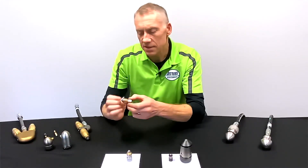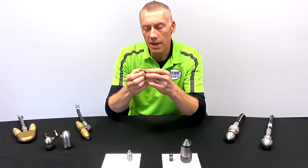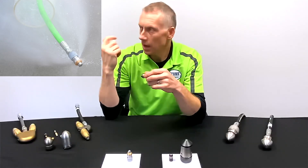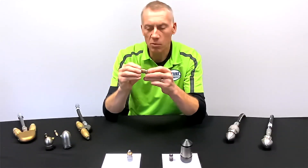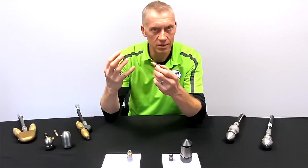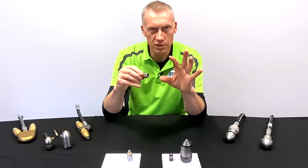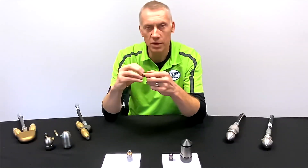The knock on these is they leak a lot. A rotating barrel spinner is not internally oiled — actual water comes through and leaks out at that point to create lubrication. You can see in the video how much leakage is coming out from the front of that nozzle. This cheap one probably loses close to a third of its water to leakage. To underscore that: if you had a 10-gallon-a-minute jetter, actual water coming out of the orifices to do cleaning could be as low as six and a half gallons a minute. The rest is just lost.